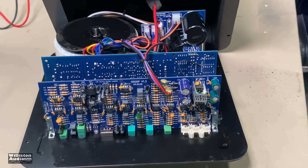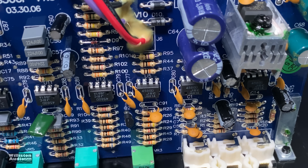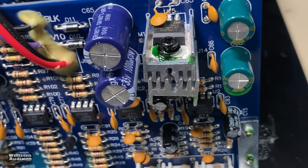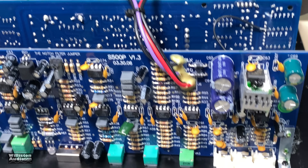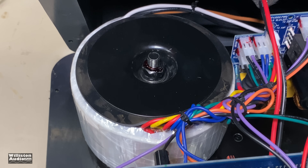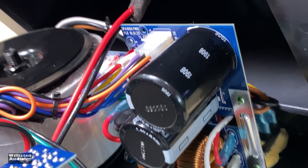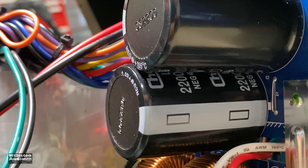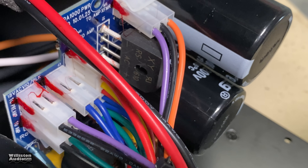The middle board is the output for the speakers — it's got all the amplification circuitry. The first board on the right is the input board for the RCAs; it also has the parametric EQ, the crossover — all of that built into that board. It's cool that it has three different boards, so if there's any problem you can probably just swap out the one that's bad. Class D amps will have a smaller transformer because they use higher-frequency switching — the architecture for Class AB versus Class D is quite different.